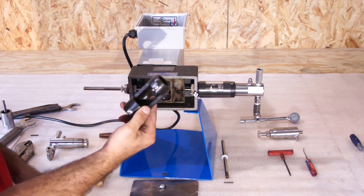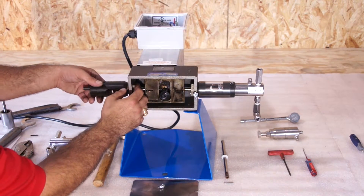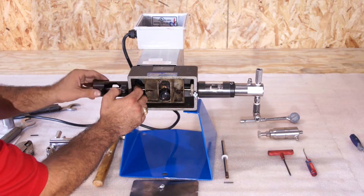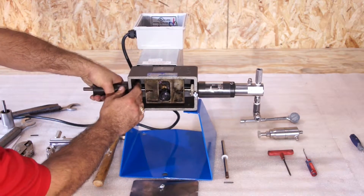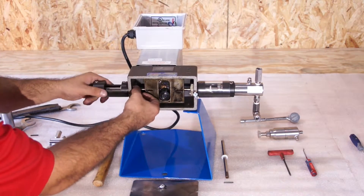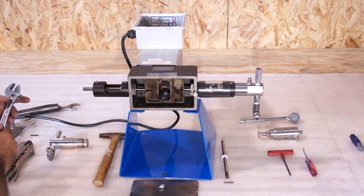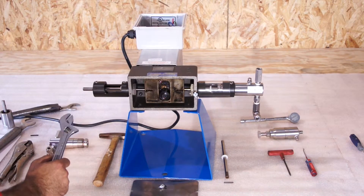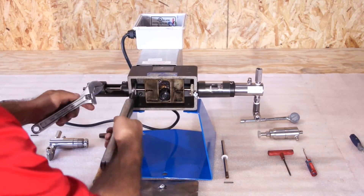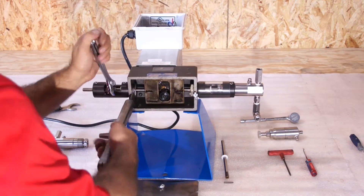Next, take your yoke. Put it over your plunger and thread it onto the bushing. Make sure the packing access port is facing upward. Once you have that in place, you can use a crescent wrench as a backup and your inch-and-a-quarter to tighten. Lock your crescent onto the yoke and tighten the bushing to the yoke.